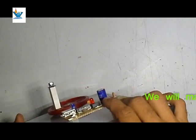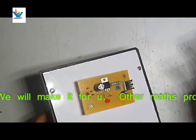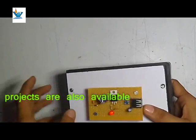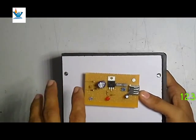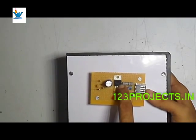When we rotate this wheel, we finally get a regulated five-volt supply. This project converts mechanical energy and kinetic energy into rotational energy, and then rotational energy is converted into electrical energy. The circuit then converts that energy to a particular level with particular filtration suitable for your Android phone.